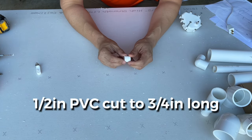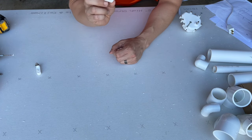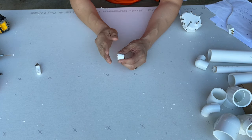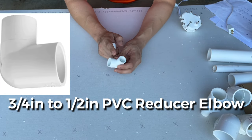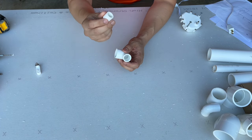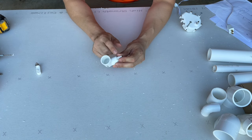Okay, for the next step, we need a 3/4 inch long PVC piece that is size 1/2 inch. So this is 1/2 inch size PVC cut at a length of 3/4 inch. We're going to get a reducer. This PVC reducer goes from 1/2 inch to 3/4 inch. I'm gonna link all of this in the description below. So this 1/2 inch is gonna go right here where the 1/2 inch entrance is at. We're gonna use some PVC cement glue to attach it.